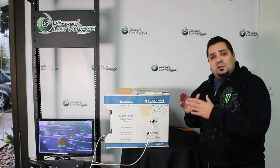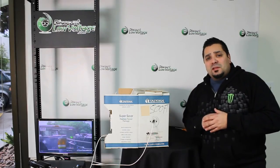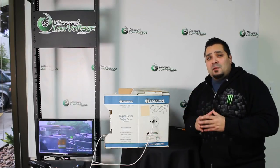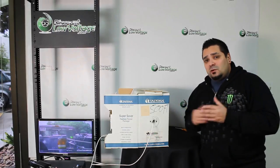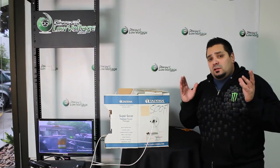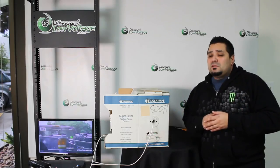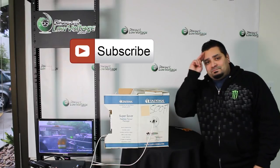I do have it installed — not me personally, but the maintenance department of this company purchased a bunch of the same exact cameras. This is one large building, about 120,000 square feet, and the cable runs are going to be three to five hundred feet, so I was just double checking here for them — I want to make sure everything went smooth. Hopefully this helped you and solved your question as far as how far color can go on coax. RG-59 is what we're using, and 500 feet is pretty far — that'll probably take care of most everybody's needs. Don't forget to subscribe to the channel. Thanks, later.